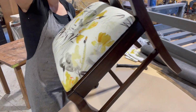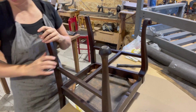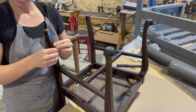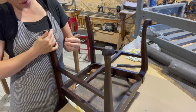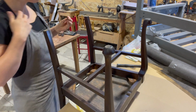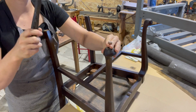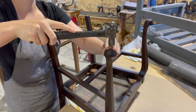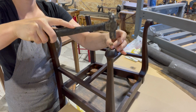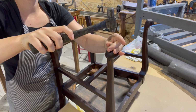So the last thing we're doing for these chairs, and I do this on a lot of pieces that I do, is adding these neoprene gliders, and they are friendly to all floor types, and they don't have an adhesive, which, you know, once it falls off, it gets the floor all sticky. So just got to go kind of off center of the old hole here.